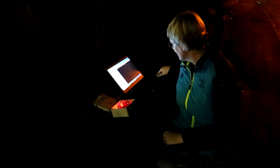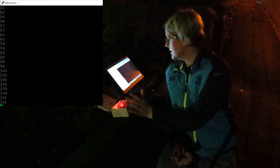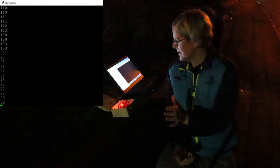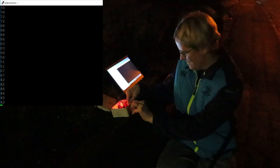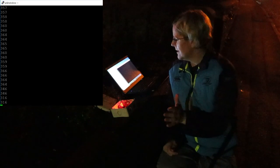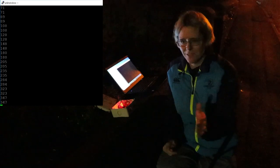So I've got a really interesting problem with the time-of-flight sensor now that it's outdoors and installed. If I put my hand up there are some numbers, but they're a bit weird — going closer the numbers increase and then decrease. Further away it reads 110, then 90, then 72. But if we take the tape off — it's just sellotape, plastic tape — the readings now make total sense: 350, 36 centimetres, spot on, and as we go closer they go lower and lower, down to 47 millimetres. So the tape is interfering with the sensor — I think it's reflecting the infrared light back into the box.